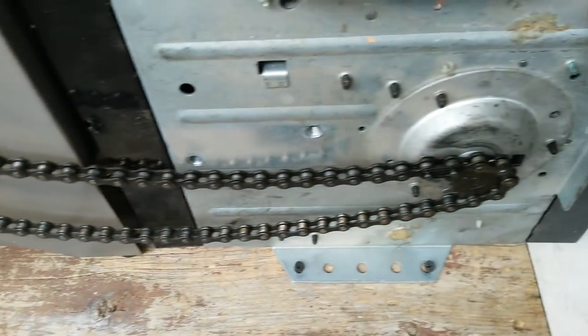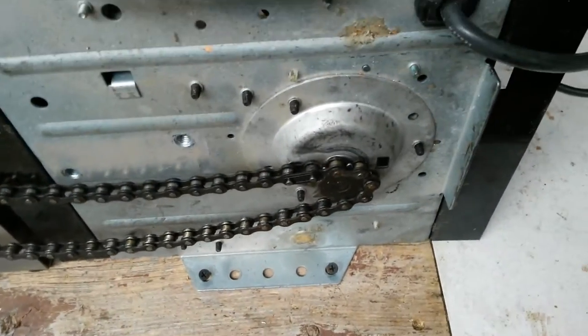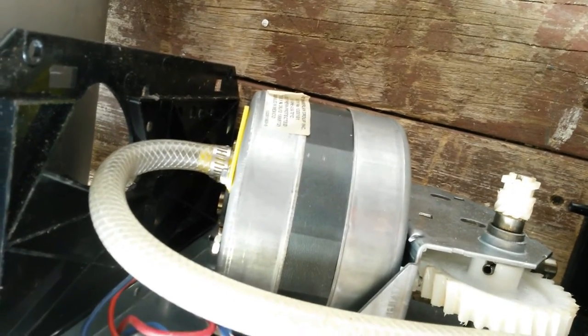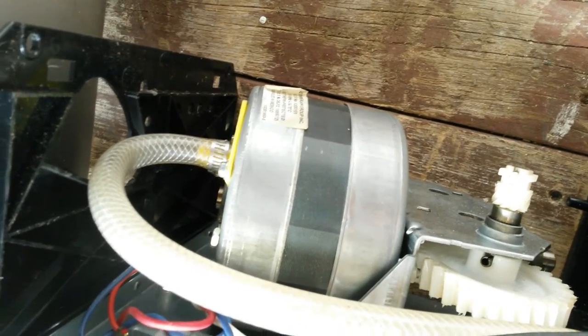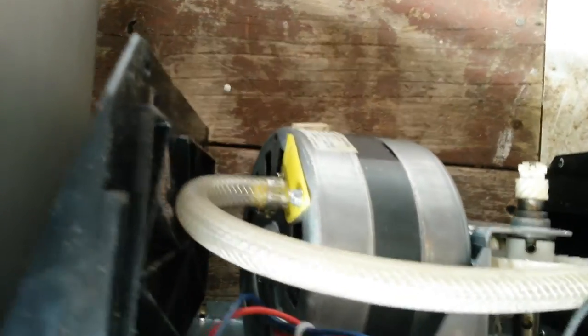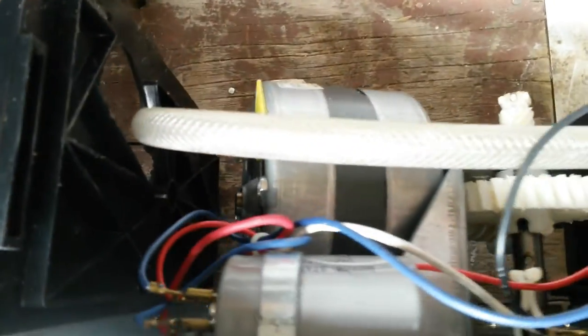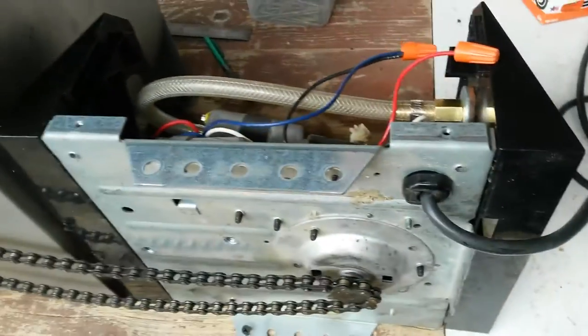I used the same chain from the garage door opener, and I tried that. But I discovered that garage door opener motors are only designed to run for about 20 or 30 seconds at a time, so this one was getting way too hot — it would overheat and shut down after about three minutes of continuous use. So I added an air cooling system, hooked it up to my air compressor, made a little piece that fits right on there, and it blows a steady stream of air through the motor keeping it cool. And here we go — in operation!